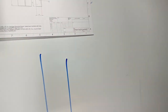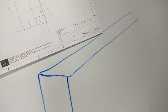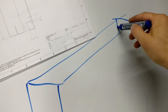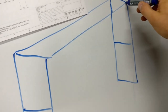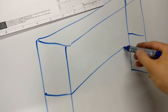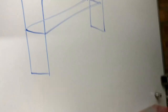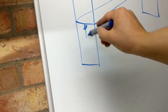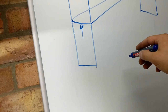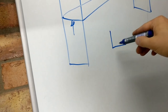This is what it's going to be like. We've got angle iron, so we're going to have some legs like that, some stretchers across the top — one there, one there, one there — and then of course a couple across there like that. Now because it's angle iron, we're going to have to trim the ends of these bits here; these are going to get the treatment. So looking from the top, that's that bit in cross section.